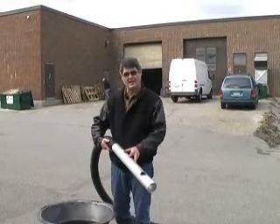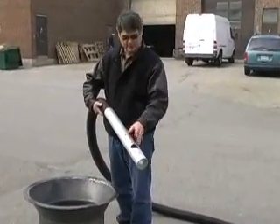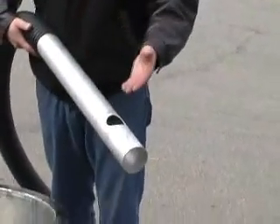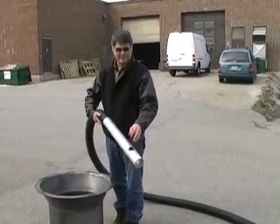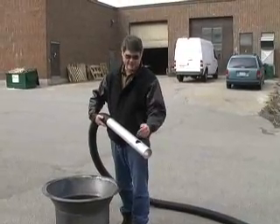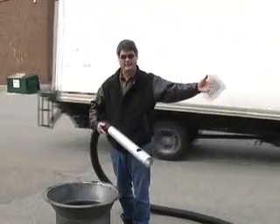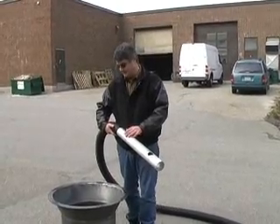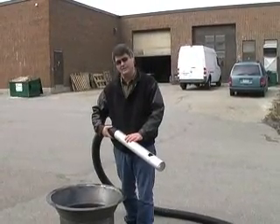We're going to turn the machine on in a second. What I wanted to show you is the tool here. We have a 2 inch hole just in front of the 3 inch nozzle. This 3 inch nozzle can be made in different configurations — this is just easy for us for the test. What this hole does is it prevents all of the water from going into the end of the pipe all at once. Once it's past the hole, then the full effect of the vacuum pulls the material back into the pipe. We've got this connected to a 50 foot long hose for the test and we will show you how it works very effectively picking up golf balls from the surface of water.